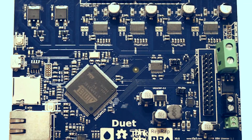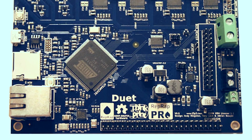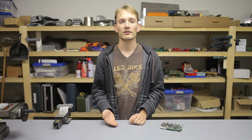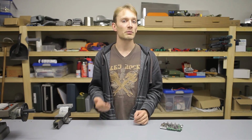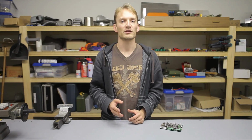This is also the same architecture that is used on the new Arduino Due and is also quite similar to what is used in today's smartphones and tablets. It could even run Linux. Now, of course, being a vastly different architecture from the old Atmegas, firmwares that are optimized for AVR won't run on the Smoothieboard without some major modifications. That currently includes Marlin, Sprinter, Repetier, and pretty much any other firmware. So the guys behind the Smoothieboard have also developed Smoothieware, a firmware specifically made for the Smoothieboard.